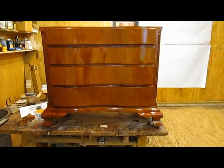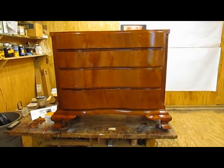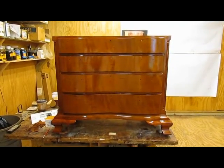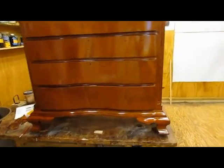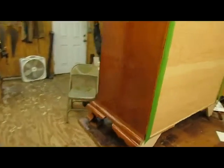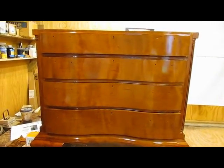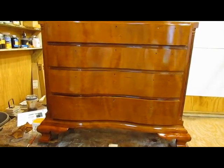I've got seven coats of Water Lux on the chest now and as you can see it's got more than enough film finish on it. It's of course much too shiny for my taste, so I've got to wait at least a week for this to cure, then I'll rub it out with steel wool and wax it. I just thought I'd let you take a look at it at this point — it's come out pretty good. I don't have the drawer slid in all the way because I don't want it to stick, but it looks like the finishing is about done.